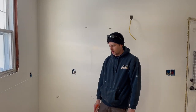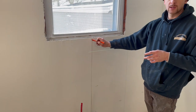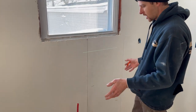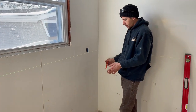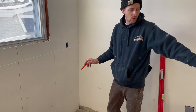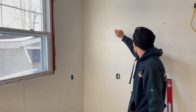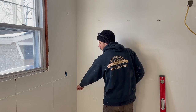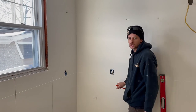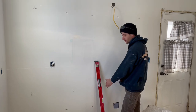All right, another thing you have to do is lay it out on the walls, make your marks on the walls to show you where the cabinets are going. So I got my center for the window. It's a 36-inch sink base, which will bring me to the edge of this window. And then I got a blind corner here. But the blind corner cabinet, which is right there, is 42 inches long ways. But my top one, I'm gonna have a 24 in the corner, and then I'm gonna have a 21 at the top, which equals out to 45. So instead of slamming my blind corner all the way in this corner, I'm gonna have to hold it off 3 inches. Because this base is gonna have to line up with the edge of this because my microwave and my stove is going here.